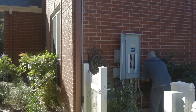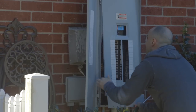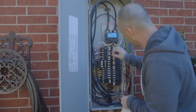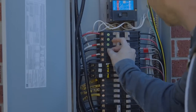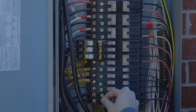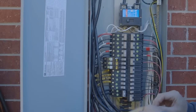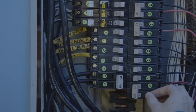Next, label and record the circuit breaker panel details. If you're measuring one breaker panel, find the main breaker panel for the house, not a sub panel. Label each breaker in the panel using the provided green number stickers. You can number the breakers any way you want, but we found it easier to manage later if you first number the left-hand breakers top to bottom, then the right-hand breakers top to bottom. Check with a manual if you need to measure circuits for more than one breaker panel.